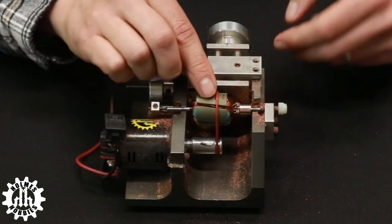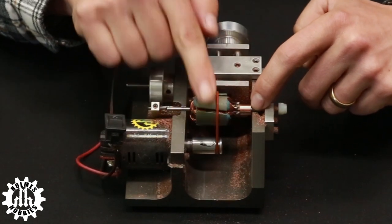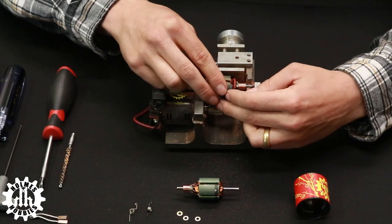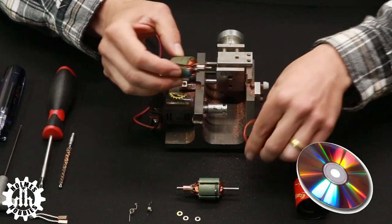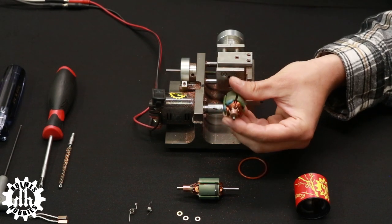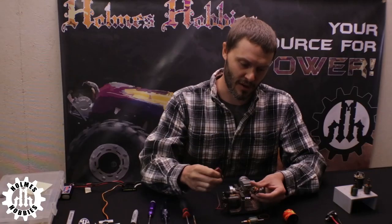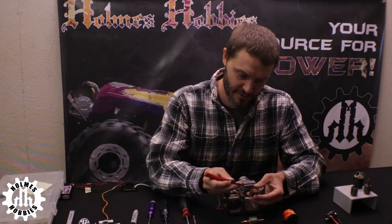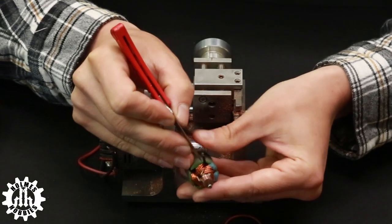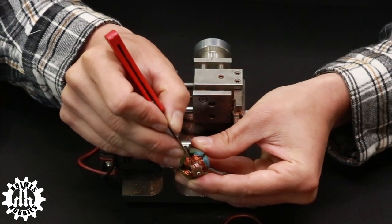That was a full depth cut and the surface is completely clean and mirror-like, sort of like the back of a CD. Next we need to inspect the commutator and ensure there are no loose bits. A hobby knife or small knife is a good tool for this — run it down each of the segments ensuring it is nice and clean.